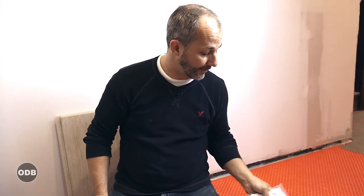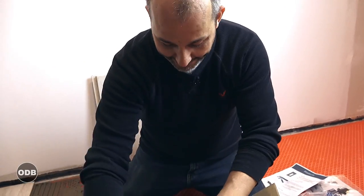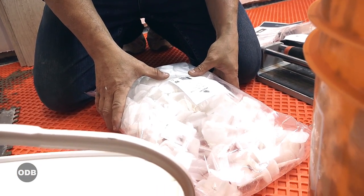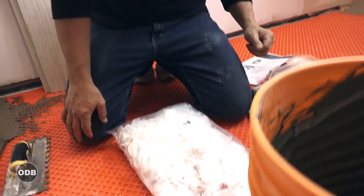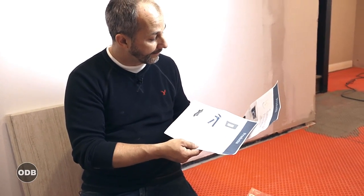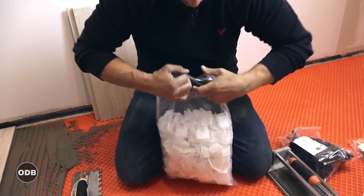I don't like to work with skinny tiles so that's not an issue. These wedges are great for starting off your tile around a tub — I'll keep those, they look pretty serious. The box could have been a little bigger, but that's all right. Let's take a look — the bag doesn't tell me how thick they are. Three millimeter — that would be one eighth of an inch, and that's exactly what I wanted to use.